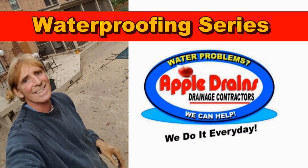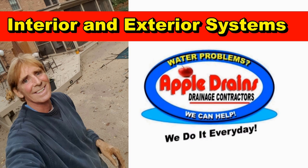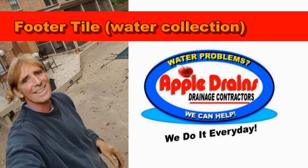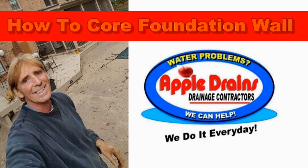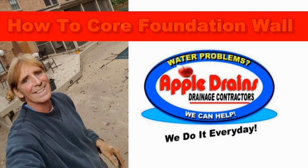The Zoller M53 is one of the best pumps on the market for removing water from your crawl space or basement. We also use a Zoller M98, which is a half-horsepower pump. We attach that to French drains in backyards, channel drains, and driveway drains — and these pumps can easily keep up with hurricane-force driven rains.